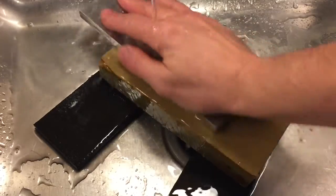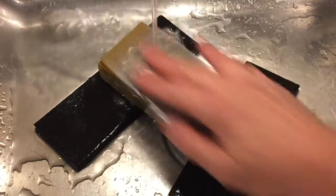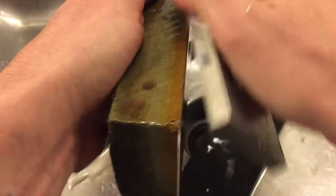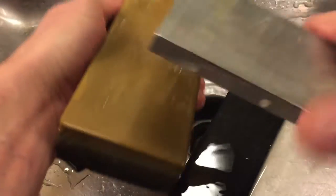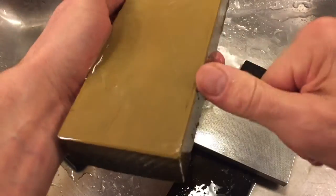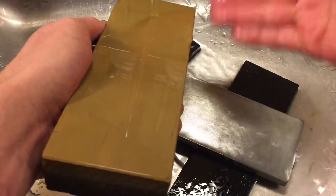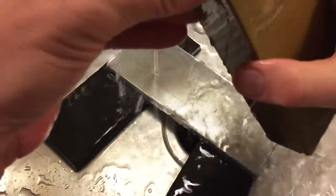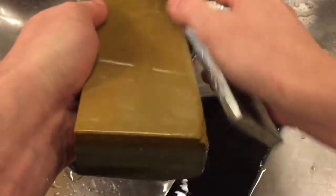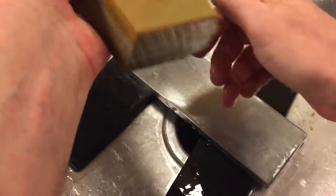I have a very worn 400 and this is what I use on the chamfers, so I don't have micro teeth giving me grief. Because your blade is going to be coming along the stone — if this edge has striations from the diamond plate, even micro ones, you can transfer a major amount of aggravation to the edge. So you should work at smoothing it out. I do a little bit of rolling. The ends are not so critical unless you're the kind of guy that runs off the end all the time — I usually hone in the middle.